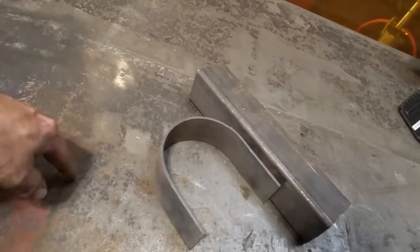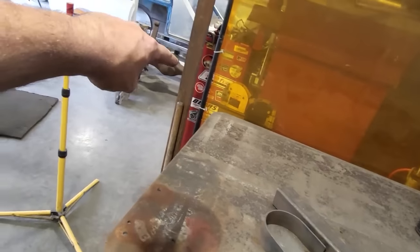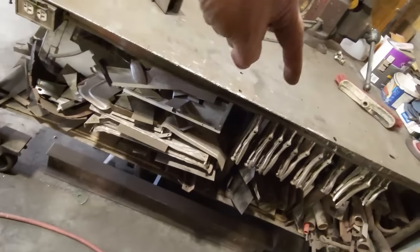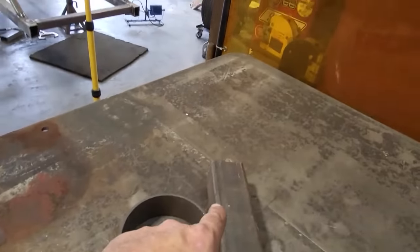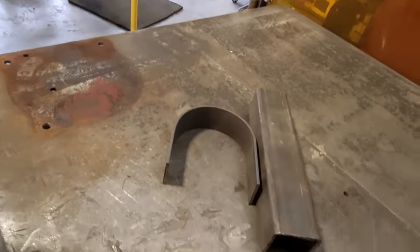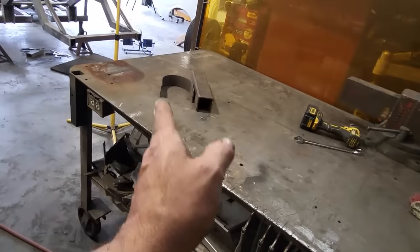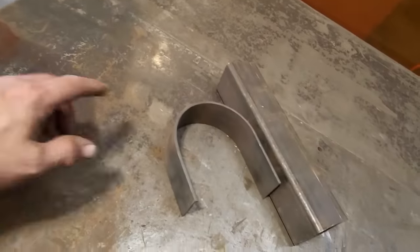What I'm going to do is make a simple manual bender here just with leverage. But I need two sides. I need the whole section. I need the whole circumference coming in around this way here, right? So I got to set this up now. So this here clears this section here. So when I go out there with a straight piece of steel and start bending around this here, it'll actually come all the way around and it'll clear back here on the outside of the bend, see? That's why I had to remove this in order to get this to work.